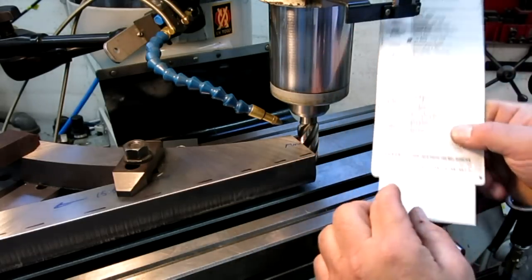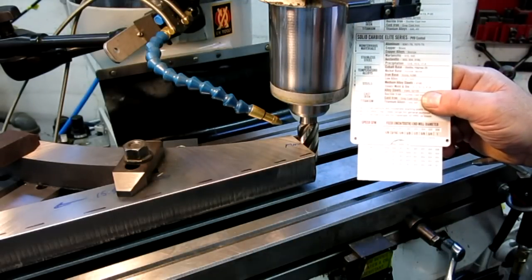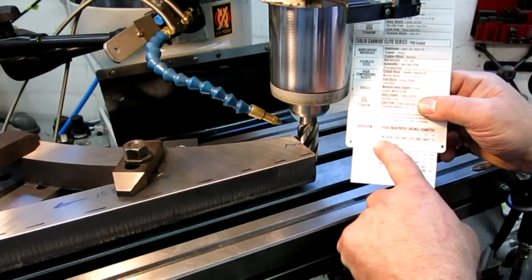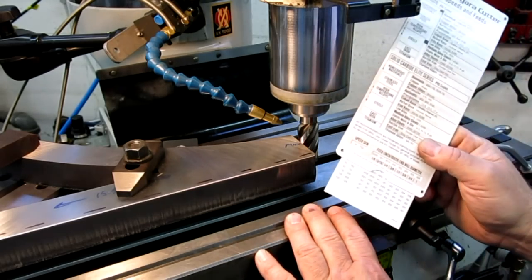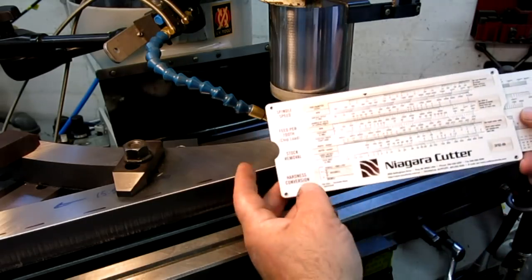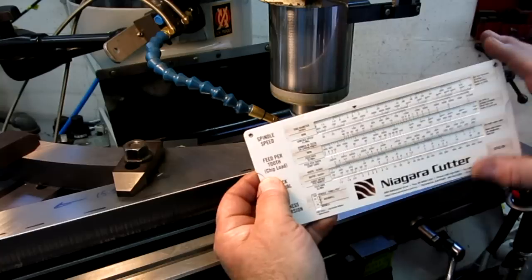So down here, we read the cutting speed, which is 50 to 250 feet per minute. Then it gives a chip load depending on the end mill diameter too, which is also important. Although I don't have good control over the feed rate here, so we're just going to skip that part. So we flip it over now, and we want to be between 50 and 250